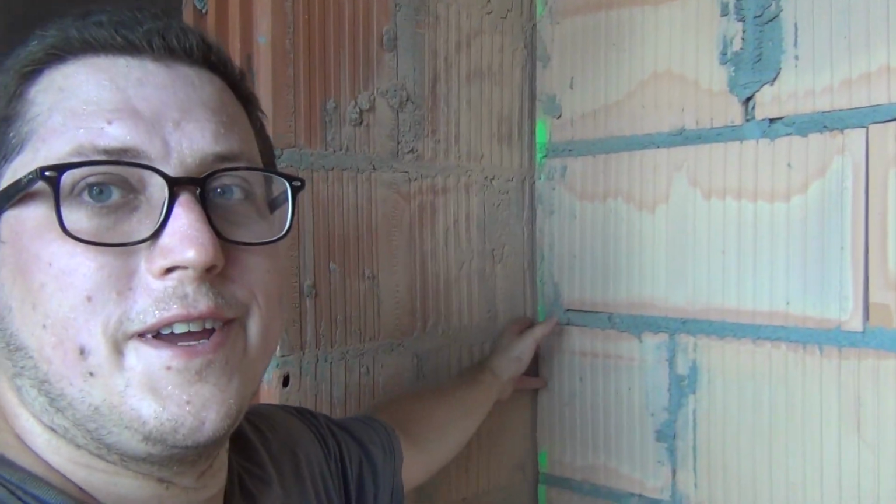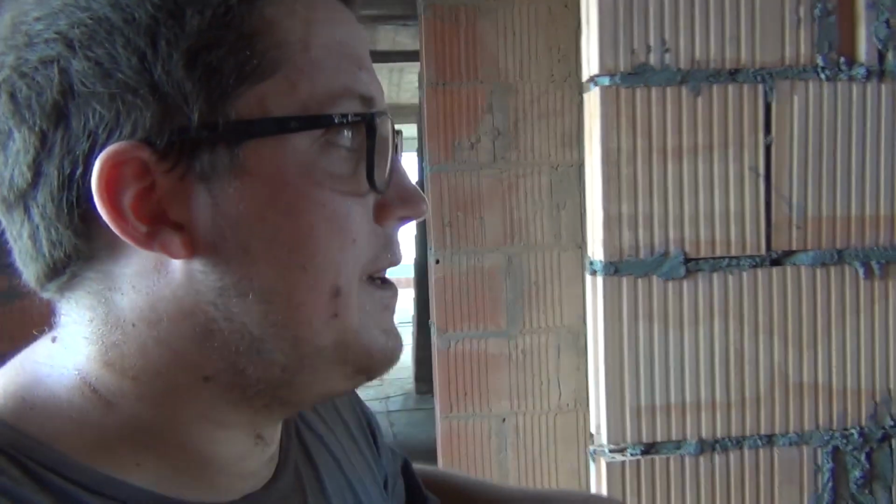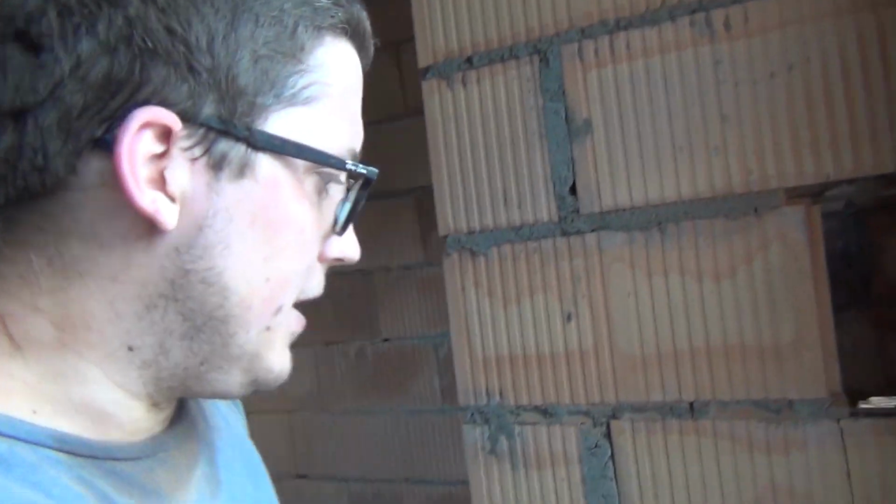Here in the pantry, I sliced these walls off, not only for the rebar that is in them, this is sliced through, but also the bricks so there's no mortar. You can see the gap of light shining through on both sides, and we're going to put in some spray foam inside those, so that they can slide with the second building, irrespectively of the main house. These you've probably already seen, these are done too.